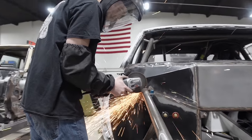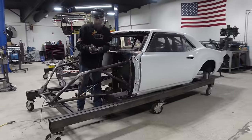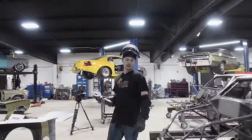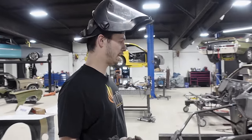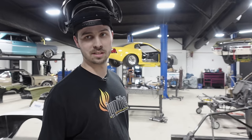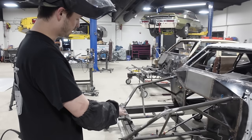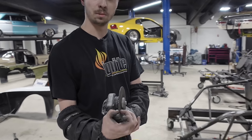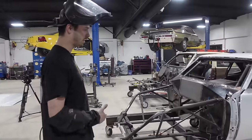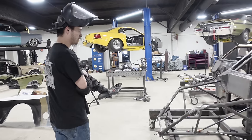Cutting time. So when you're doing something like this, as soon as all these bars are welded they get tension, and then it gets even more tension as it's raced. This is actually a Jaybird trick — you go through and cut almost all the way but leave it a little bit attached so it's not trying to bind up and pinch your blade. So now I've got almost a relief cut on everything, and then I'll go back through and final cut everything.